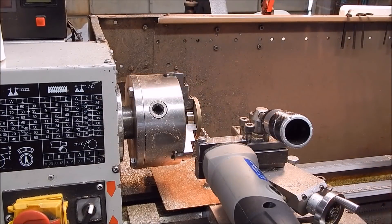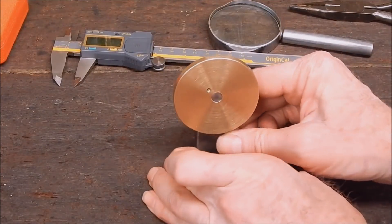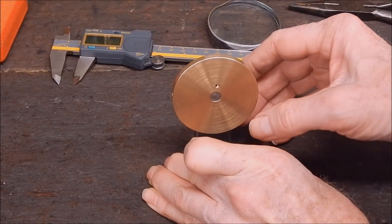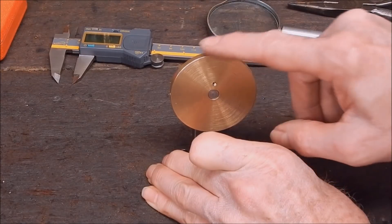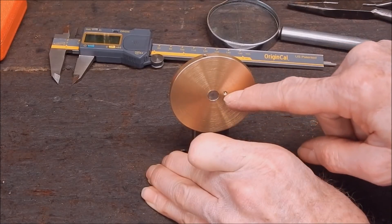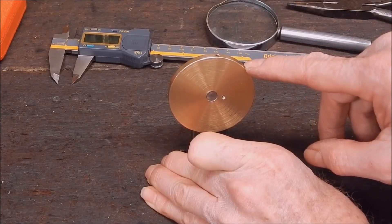She's all done — we're halfway there. The flywheel's working alright. You can see I've also radially drilled one of the conrod bottom end holes. You basically just measure from the centre out and halve the stroke travel to get the rod position.